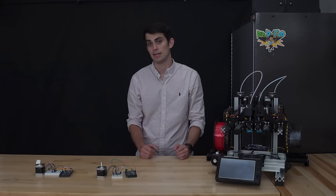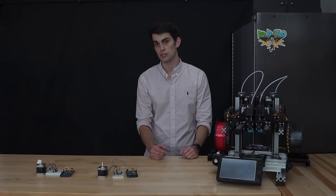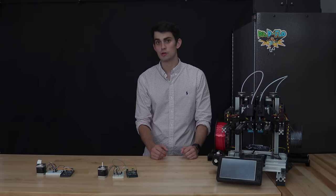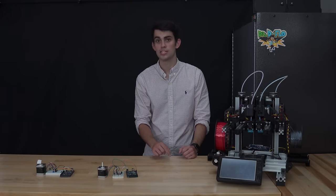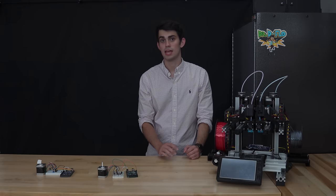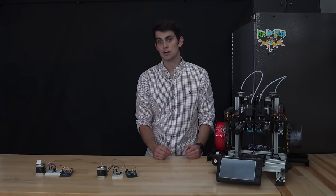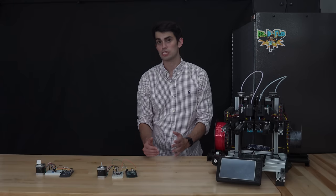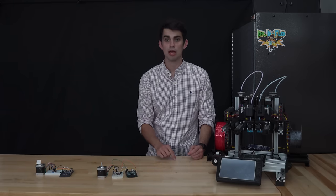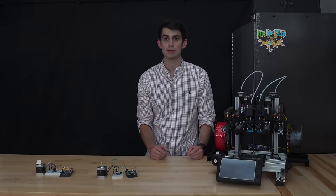motor's accuracy remains unchanged. There are also other issues when employing really small microsteps, such as the lack of incremental torque between microsteps and the need for the microcontroller to have higher processing power to generate faster step pulses. Microstepping really is a fascinating topic, and I highly recommend clicking on some of the links that I have provided. The last couple of things that I want to talk about in this section are how to enable microstepping, what microstepping means for our steps per millimeter conversion, and the microstepping interpolation of the Trinamic stepper driver.